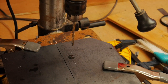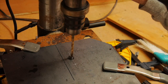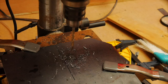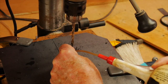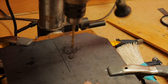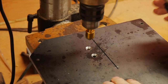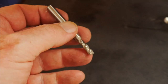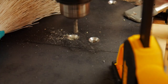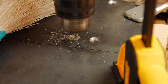The markings are now on the bottom of the plate, and I'm going to drill mounting holes for the bolts at those locations. As I was drilling them, I did have a little mishap because I was not careful enough in my measurements — one of the holes was a little off. I want to tell you about that mistake because we all make mistakes and it's about how we recover. After I finished drilling, I countersunk the holes to receive the bolts from the top. But I'm now going to use an end mill to enlarge one of the holes. I don't have a lathe, but you can put an end mill into the chuck of your drill press and actually drill a hole sideways.